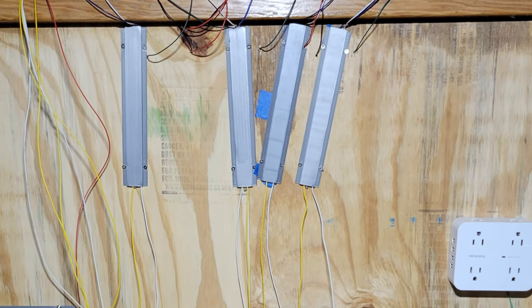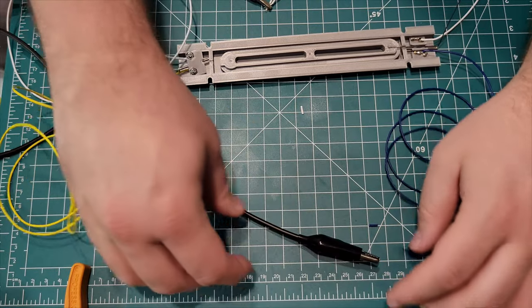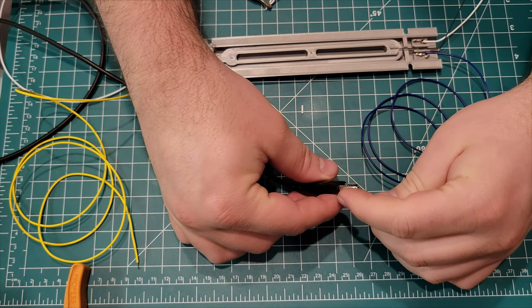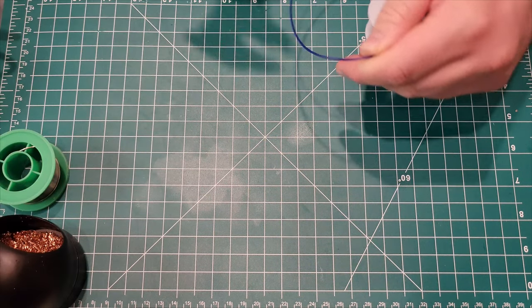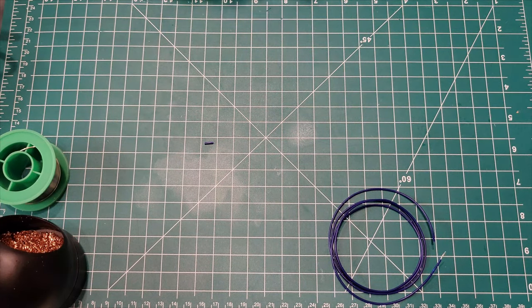Now, let me show you how I built 9 of these and installed them on my coffee table layout. The crimped muscle wire assemblies I got did not come with lead wires attached, so the first thing I needed to do was solder lead wires to the crimps. I used very long leads so I can trim them to size later.